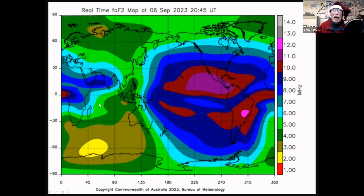But already, by the time this area here moves over here, so was the moon. And I was pointing on my moonset into this stuff, and it really made it tough. Lots of QSB, very erratic signals. It's one of the issues about trying to work EME from the TEP zone: you have these huge areas of ionization that come across you every day, and your best time to do anything is to work on your moonrise when it's like this, and then when it moves over and gives you a clear spot to the west, that's the best time to work for your moonset, and they don't happen the same day.